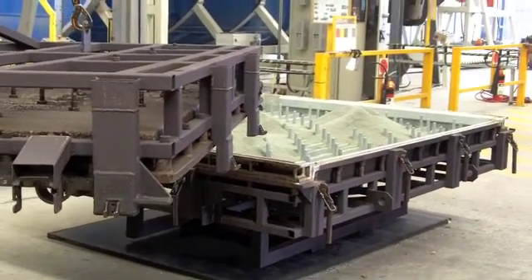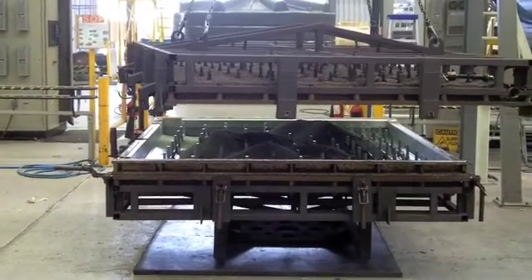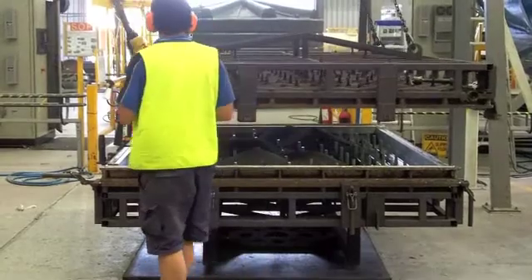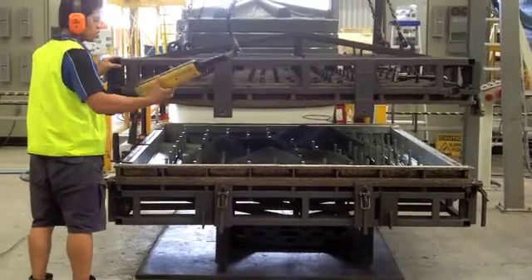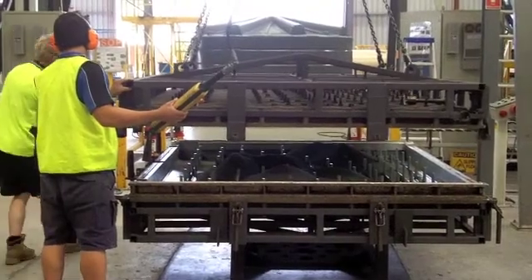The process used in the manufacture of the Thin Tanks is called Rotomold. We currently have the 1000 litre Thin Tank mold and you can see that we are filling the bottom half of the aluminium mold with polyethylene powder. You may also notice the mold itself has over 90 pins or cross connectors in it, and it is these cross connectors that give the Thin Tank its strength and allow it to be so thin.